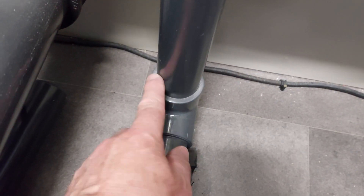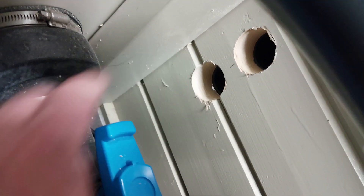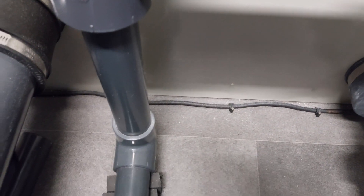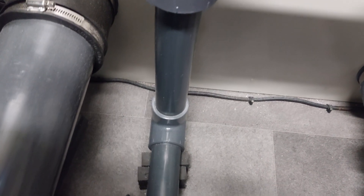There are two pipes coming through — there's not a lot of space for getting the pipework out. This is my current setup to an electro heater. What I'll be doing is cutting the pipe here, turning that elbow across, going through that hole there, and cutting this elbow out and replacing this piece of pipe. That will go underneath here, up the back, then out through the bottom hole there with just a couple of valves to isolate it. It will go through the air source heat pump first, then come back through the pipework, through where the electro heater is, and back out to the pond.